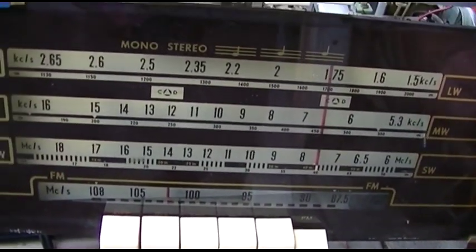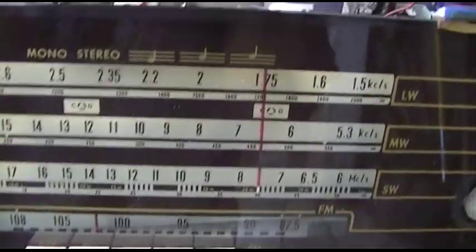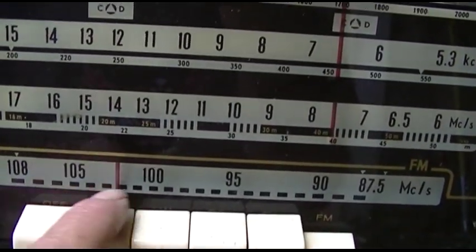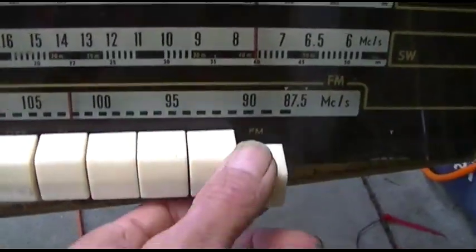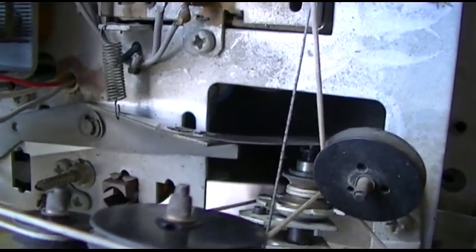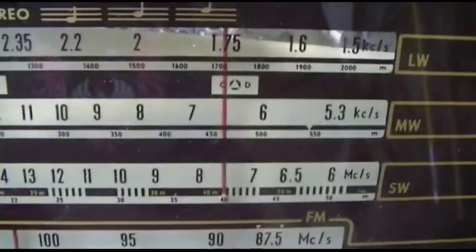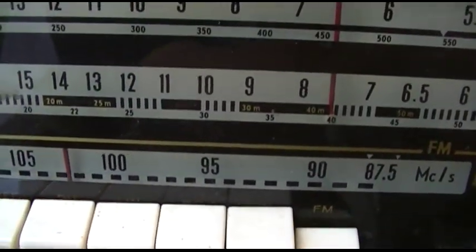You can see it doesn't have a whole bunch of power, but the tuner is kind of sensitive and works pretty well. One cool thing about this is the FM is down here at the bottom, and the AM and short waves are up here at the top. There are clutches, so when you go from FM to broadcast — you can see them here — these different clutches move and engage the different tuning gangs. You can be on FM and only adjust the one at the bottom — see it moving.